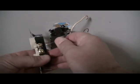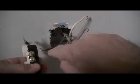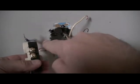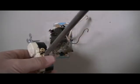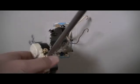When putting your wires back on, make sure the hook is twisted in the direction the screw tightens down — so hook it on like that, in the same direction you'll tighten the screw, and it will really grab the wire nice and tight. The extra unused screw — tighten that down as well so it's not sticking out.